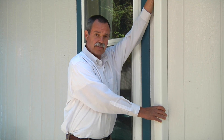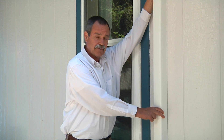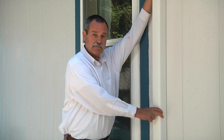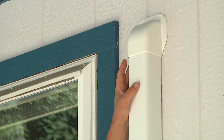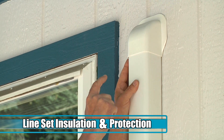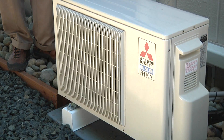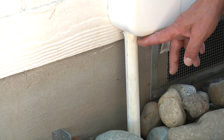This material right here is called a line hide and as the name suggests its job is to hide the lines. The lines underneath here are electrical, refrigerant line set, and also the condensate from the ductless heat pump inside the house. Line hide is a bit like Legos — there's a specialized piece for every purpose. This piece right here seals the hole that was made in the house to get the line set and electrical in, turns the 90 degrees, and then joins the channel going down the house. The job is to not only protect the unit but also add to its aesthetic appeal. This half-inch PVC is the exit line for the condensate, and it's important that the condensate line drains freely.